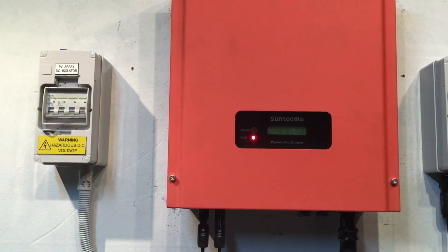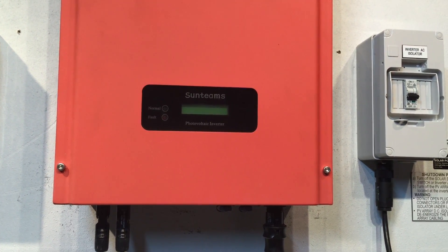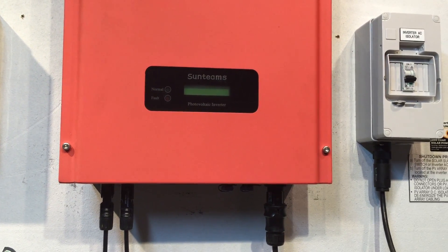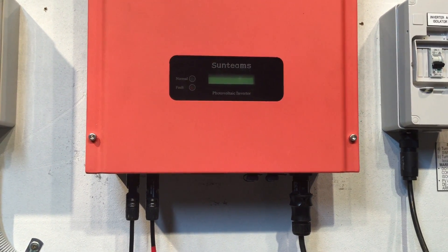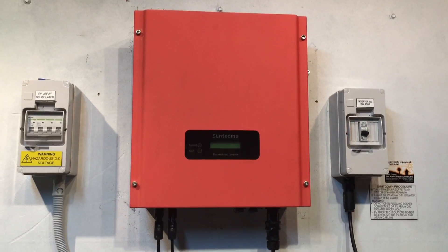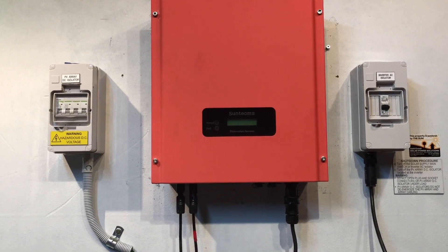We'll let the system disconnect altogether and see what comes up. Now if after a reboot you're still having this problem, what's going to need to happen to get your system operational again is the inverter will need to be either repaired or replaced. You may be able to cover it under warranty, though I haven't found KL&E too easy to deal with regarding warranty issues. But there are a couple of things you'll need from the side of the inverter to make a warranty claim, which we'll go through in just a moment.